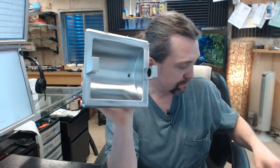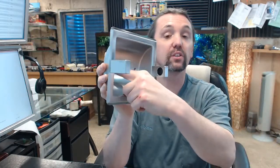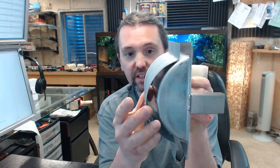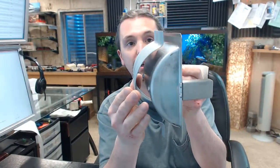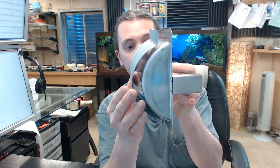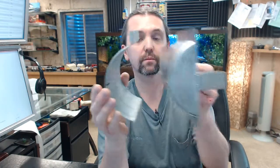There is a reference to the drywall installation, which uses these two dimpled holes in the back with a couple of 8-32 machine screws. These are a combination thread that allows you to go right into the back of the unit into a stud. However, this installation features the No. 39 drywall clamp: when you create your rough opening, the clamp goes in first. You run the screws into the two slots, and the more you tighten them the more the clamp tightens against the wall around the drywall — that's the installation of the drywall clamp.